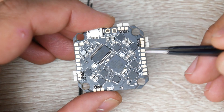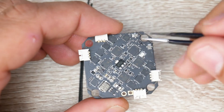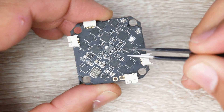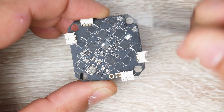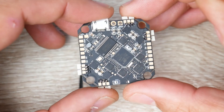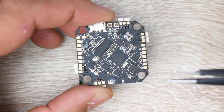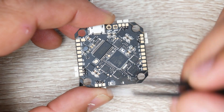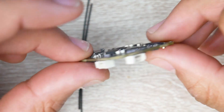One reason they went with dual-channel FETs is that this board also has an FRSky D8 receiver built in — you can see the antenna ports here and they do provide antennas. They needed a bit more space for the receiver, hence the dual-channel FETs. I've tried designing my own F4 flight controller with OSD and the OSD schematic alone is an absolute nightmare to route. To do all of this together on one board is on a whole other level — this is probably a six-layer PCB.